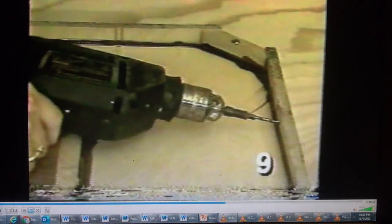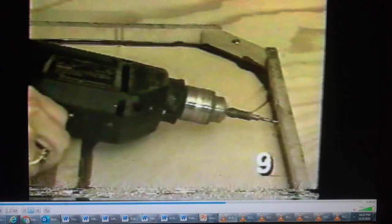We're pre-drilling holes on the cabinet backs for securing them. To keep the cabinets straight, we drew in this level guideline, and this is where the bottoms of the upper cabinets are going to hit. The way we found this measurement is we measured up 84 inches from the highest point in the floor, and from there we measured down 32 inches, because that's the height of the cabinets.